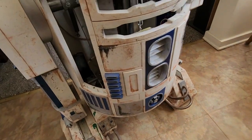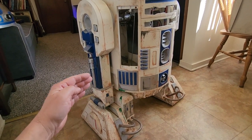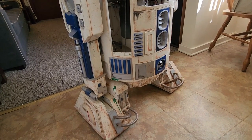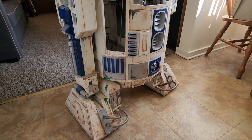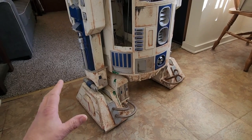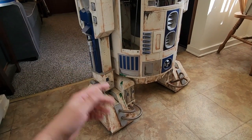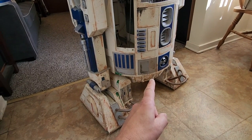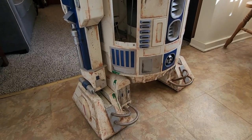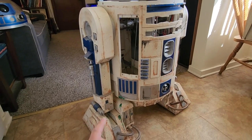Here's another interesting thing. When the droid goes from two-legged mode to three-legged mode — when the legs go back, the feet angle, and the foot hits the ground all at roughly the same time — you're in no danger of tipping over. However, when going back from three-legged to two-legged mode, that middle foot has to stay on the floor as the side legs draw back in and the reclined droid returns to upright position. If the middle foot starts raising up right away as everything draws back in, the droid is just going to fall forward. That was something we learned very early in the club.